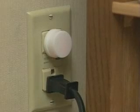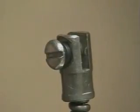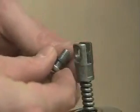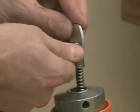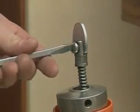To attach a cutter, first unplug the machine. Then remove the screw on the connector at the end of the cable. Underneath the screw is a lock washer. Make sure you don't lose it. Put the cutter in the slot. Replace the lock washer and connecting screw, then tighten the screw firmly.